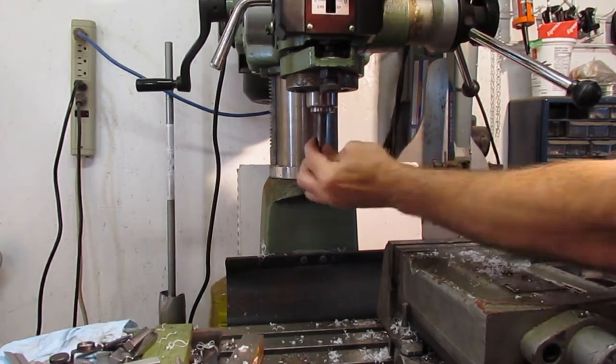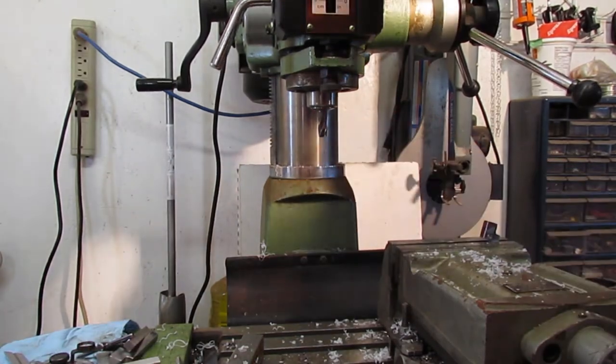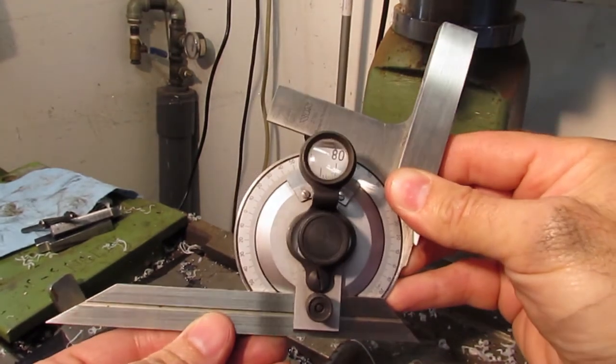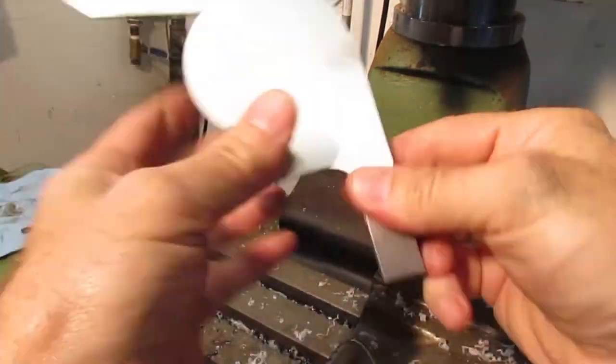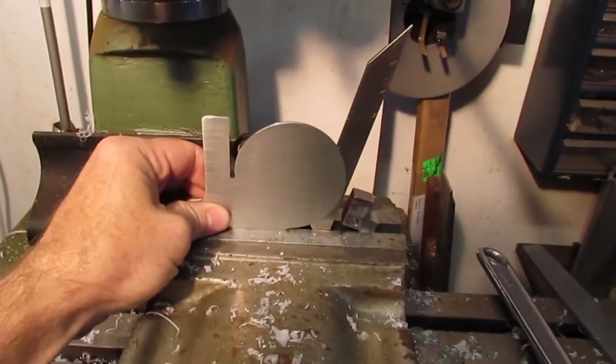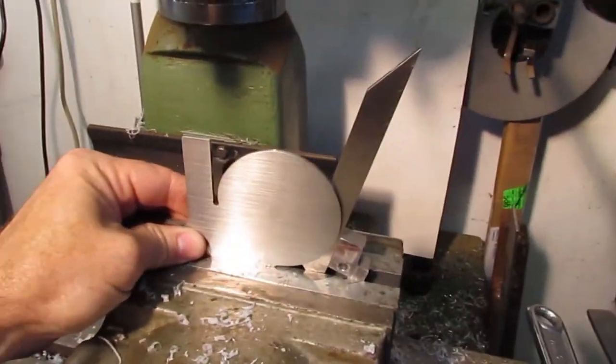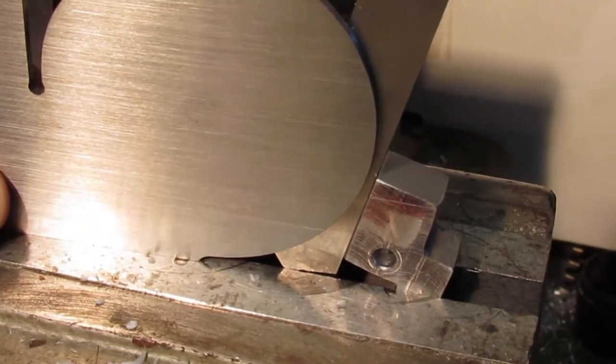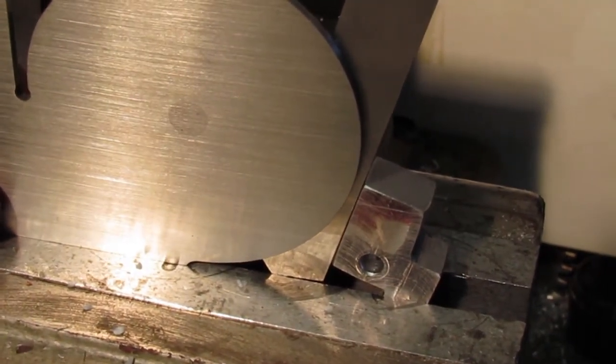Lines are scribed on each holder and milled accordingly. I milled the areas using a 1/2 inch carbide end mill. Whenever workpieces are clamped a ways from the vise jaw, use light cuts as the workpiece could move and break the end mill. To set the holders at 16 degree, I set my protractor at 16 degree and use it to align the part with the vise jaw. This is where a third hand would really be convenient.